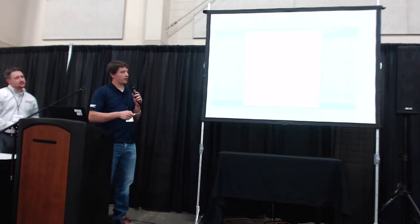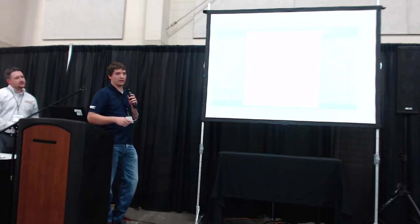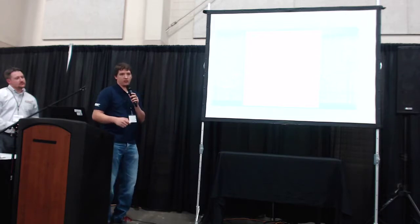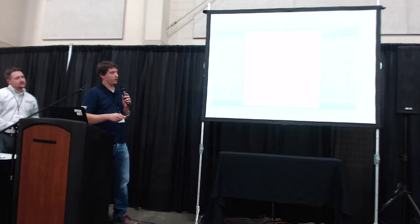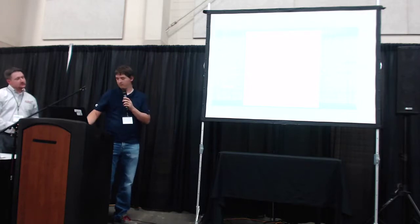And he noted it on the ticket, so anybody that was reviewing the tickets would know that that's what happened there. And as you can see, the temperature, 260. So this is an SMA ticket. That's pretty low for SMA, and that's why it was clogging and having problems. So just looking at this ticket, if you ever went back to this job, you could look at it and go, oh, you know what, they had low temperature, they were having problems, and you can verify the tonnage of this ticket, and so on and so forth. So you can kind of verify that that's where that material was placed, and if there is a problem in the grade, you can trace it back to exactly where it came from.